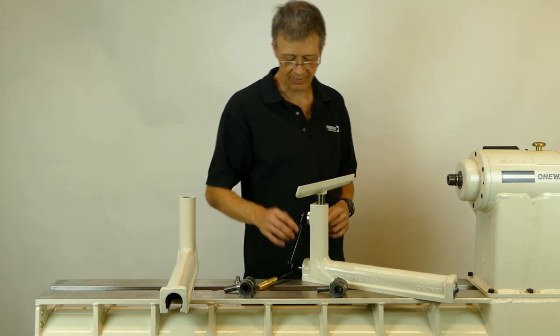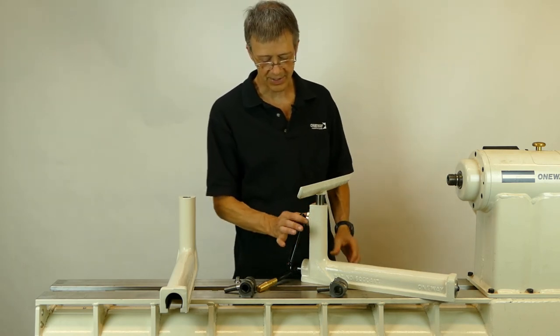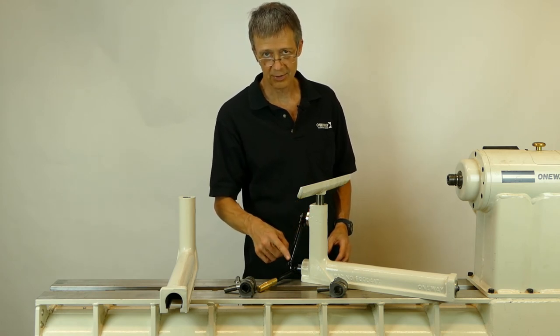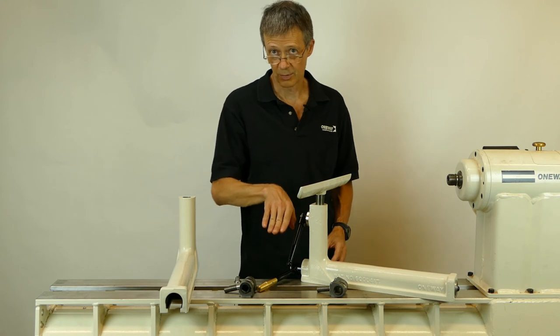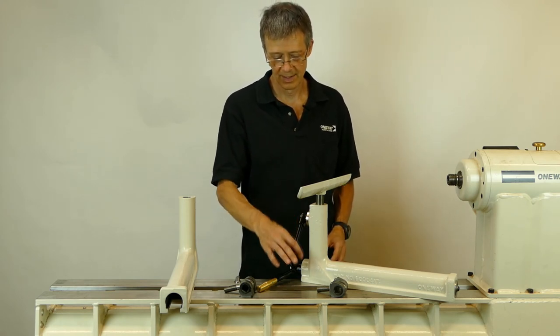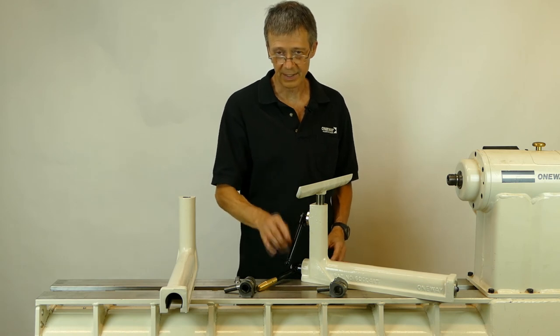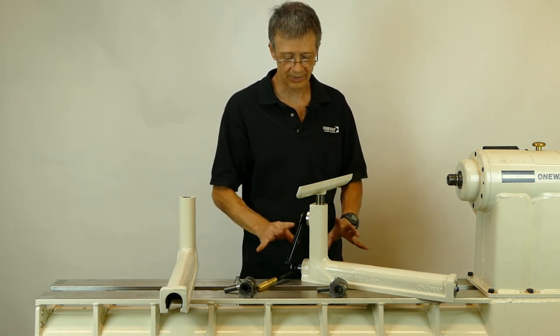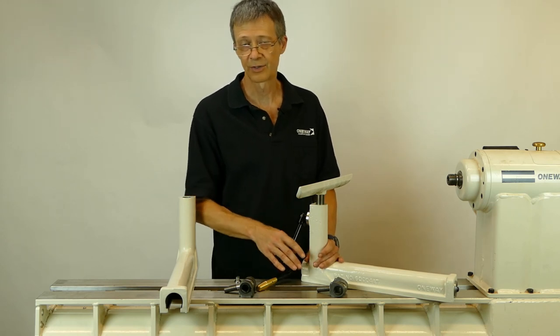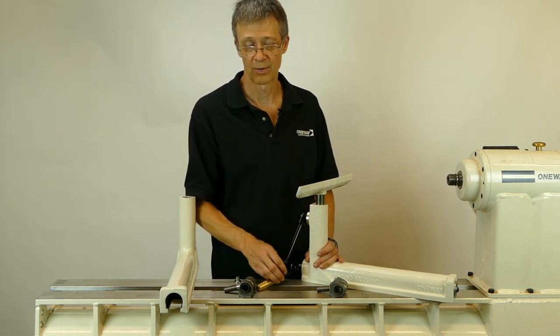The position of the handle can be adjusted by removing these bolts and rotating the pad. So if you don't like where this handle clamps, it's adjustable in one-eighth of a revolution increments. This is not a plastic speed handle. This is an all-steel handle that we manufacture in-house. And in 20 years of making the lathes, we've never replaced one that's worn or broken.